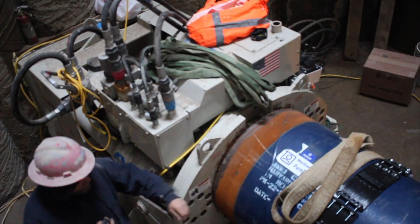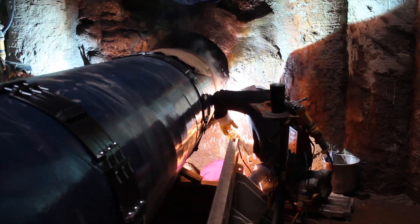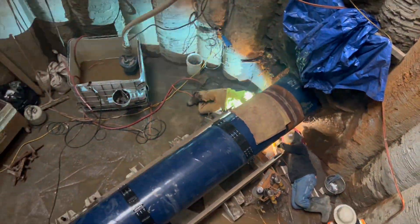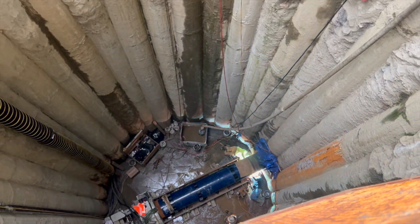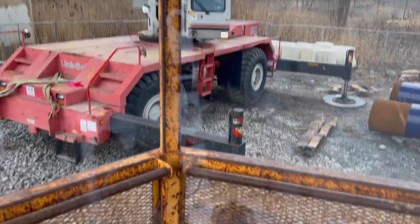There's the jacks from Ackerman. And the process is: you weld it, then you do a mag test to make sure the welds are all good. Then we put a protective sleeve over the weld and holiday test that. And once that's all passed and good, that's when we jack the pipe forward. Then bring in the next piece of pipe and just repeat.